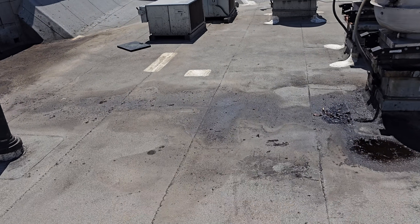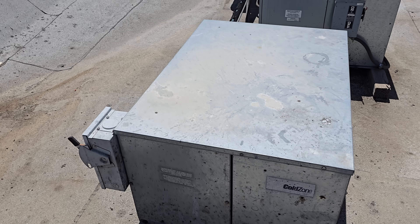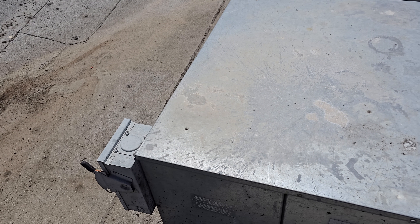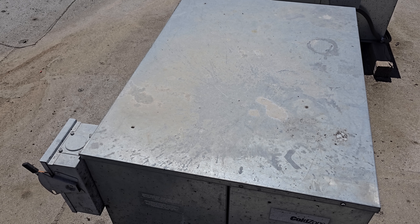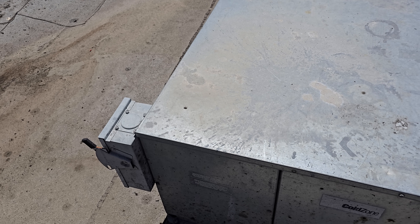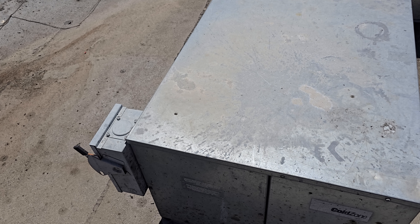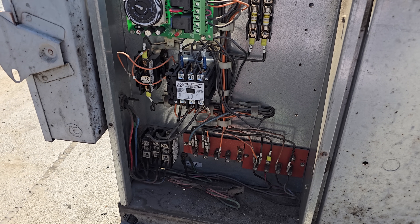It could be dirty on the inside, but we're going to get the covers and everything taken off and have a look. Something's obviously happening because the evaporator fan motors don't have any power and we checked all the breakers - seems like they're all on. We'll check power here because this is the master control for this unit. Power comes up through the defrost clock, then is sent downstairs - this unit is the master control for everything.